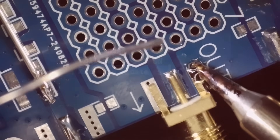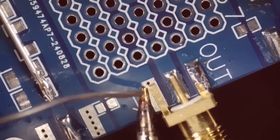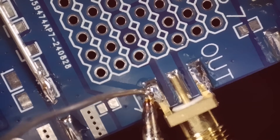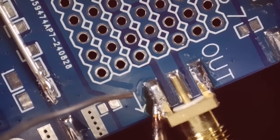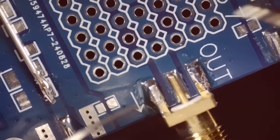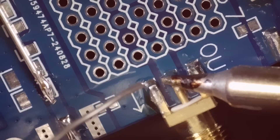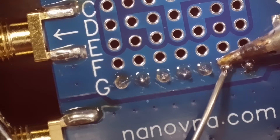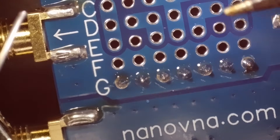I was doing some soldering on a PC board for the next video, and these SMA PC board mount connectors kind of act like heat sinks themselves. So the iron has to deliver a little extra heat, and as you can see it has no problem at all delivering the heat for those pins. As soldering irons go, it works great — I am having no troubles at all with it. I was using a finer tip here; you could use a slightly blunter tip to transfer more heat, but this worked out just fine. I did some pin headers as well — again, no problems at all. It's a fine iron. I'm pretty happy with it and I'll probably use this going forward as my daily driver.